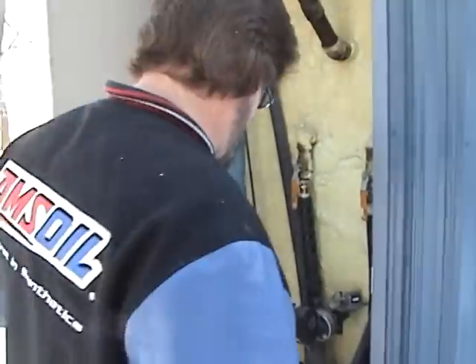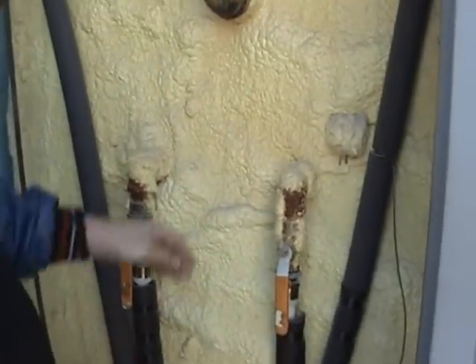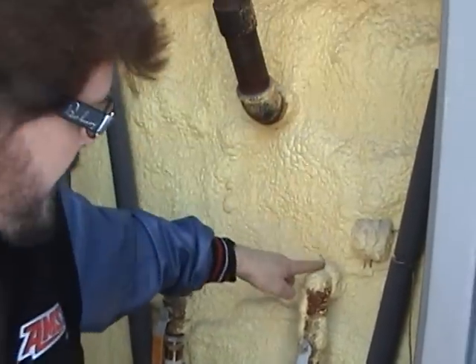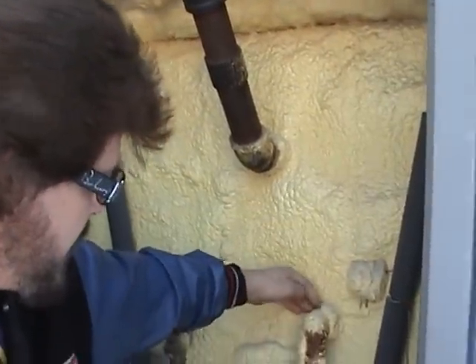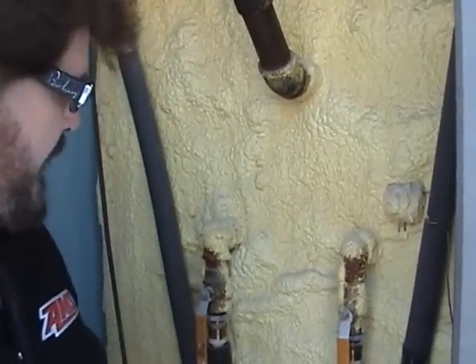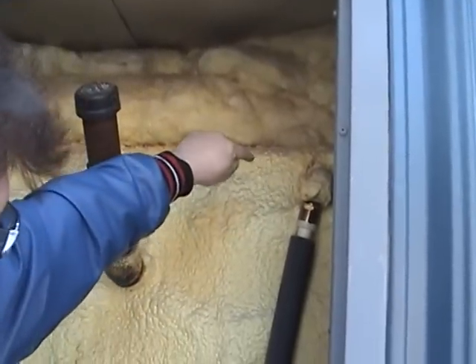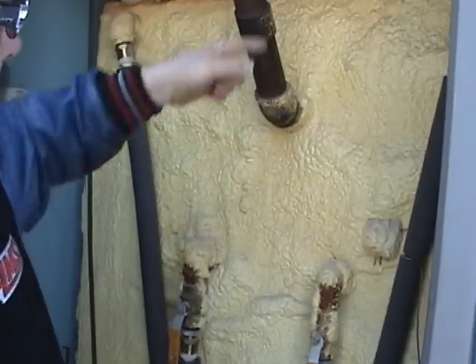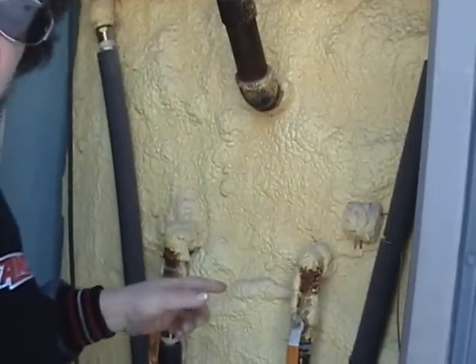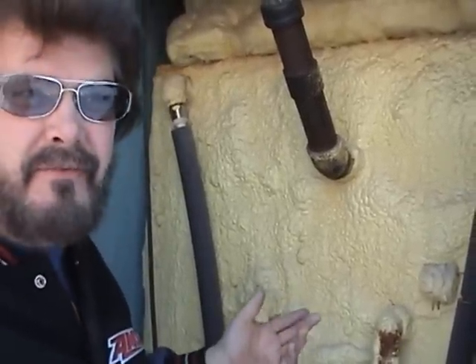Same situation on this side — got a door off the job site. This takes us into our plumbing and electrical area. Those two tubes you've seen coming through the back across the top is the water coming through, picking water up about this high, coming down, coming through here and heading down. This line going into the house comes back right here — it goes all the way to the other end of the tank on top, down a pipe and through the bottom, so the cold water has to go up and go back around the firebox. The firebox was made out of a propane tank cut in half.